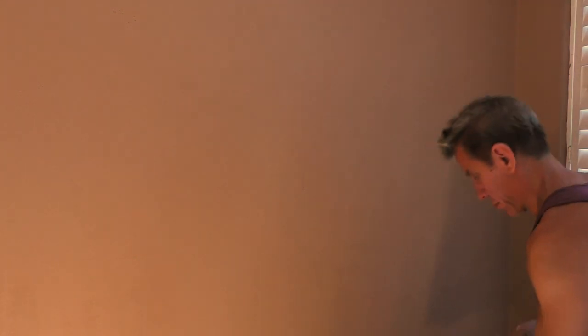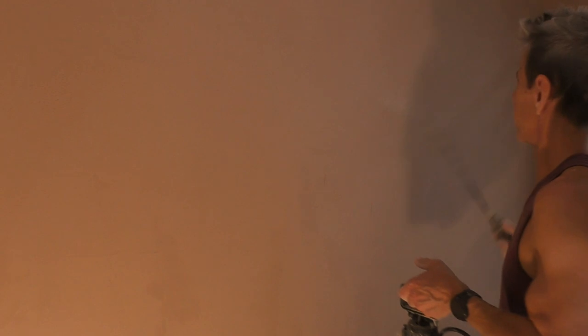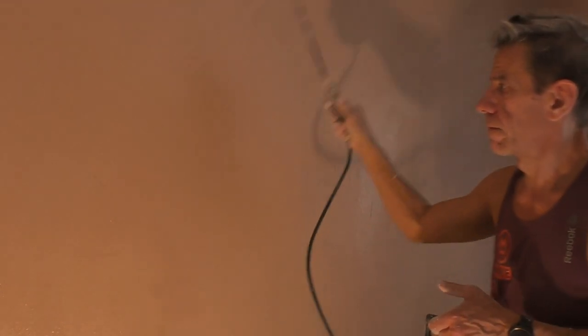You do have to be careful with this - if it's still quite wet, even with this Marshalltown twitcher that's got wide flexible wings on it, it can still dig a groove into the edges. Sometimes it'll be better to do that - I was just doing it with the twitcher at this stage where I'm at now where I've put water on the actual wall to give it a trowel up. Now I'm going to hit this with the metal blade speed skim.